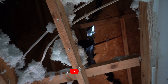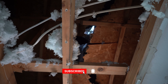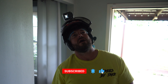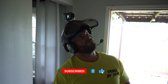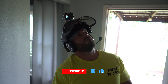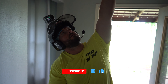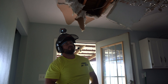One thing we want to check for is any limbs that may have come through the roof into the ceiling or into the attic. The reason being is when you start lifting the weight off of the house, if there's something hooked inside, you can cause extensively more damage. This one luckily looks like there's not too much actually piercing the roof — just mostly a large impact zone that crushed everything. So that does help us out a little bit.